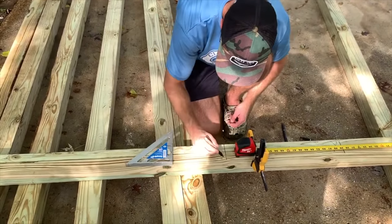since that's going to give us more elongation. So after mixing up this waterborne epoxy primer, we're going to take a 3/8 inch nap roller. And as you can see, I brought out the big guy for this. And we're going to roll this primer all over the flex product.